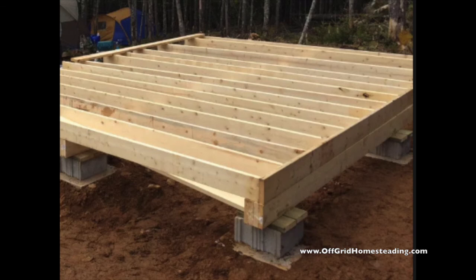Eventually we'll come back around, re-skirt, and build a cinder block frame around the base of the building, but that'll be later. Right now we just need to get the piers in the ground. We're going to take these same beams and use them as cross member supports, which will span 30 feet times three — so we need 90 feet of them — and then build the joists over those.